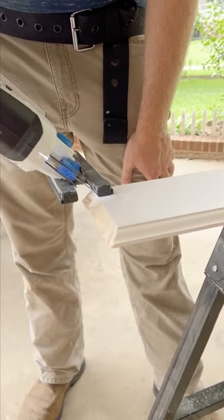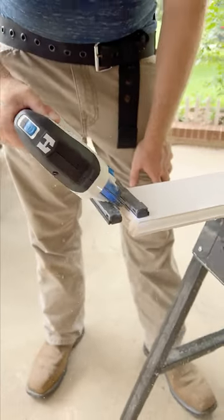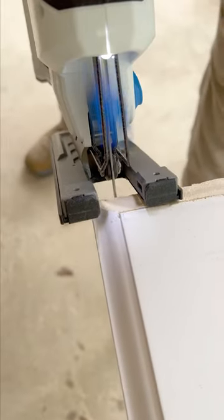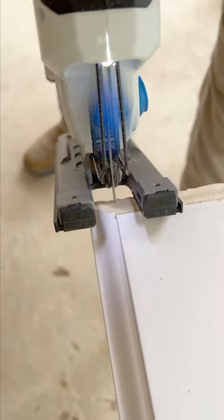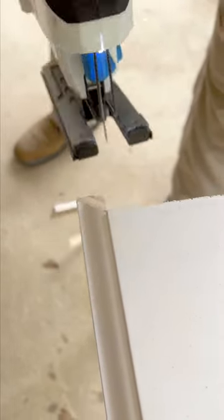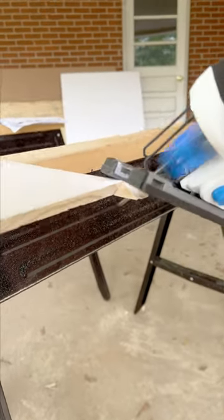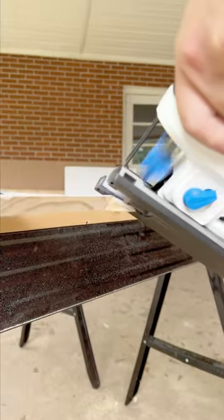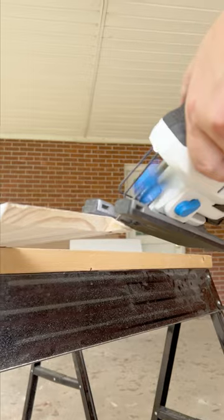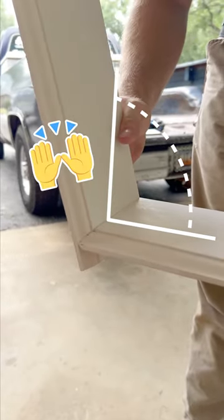I'm going to use the jig for some fine detail work here. I've got an inside corner to trim in baseboard, and I'm going to cope this baseboard and back cut it a bit. Now, if your walls were a perfect 90 degrees, you could simply cut a 45-degree bevel cut in this trim, but there isn't a perfect 90-degree corner in this whole house. So I'm going to make life easier for myself when it's time to install by coping this. I'll dial the speed down on the saw, which gives me great control over these tight cuts. That'll allow the trim to stay completely flush in the joint, even if the wall happens to be more or less of a right angle.